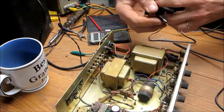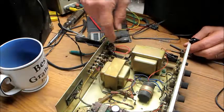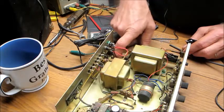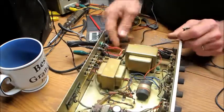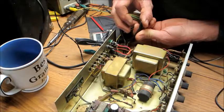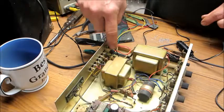The lighter plug socket fits into the back. I connected a red wire. I used my meter to check the polarity, make sure the connector was right. Red to red. Black goes down to the ground wire on the chassis, which everything seems to be grounded to. So it's a grounded chassis product. Make sure I get that little chunk of lead out of there so it doesn't short out anything. Attach the ground wire to that ground terminal. There's ground terminals all over the place here.